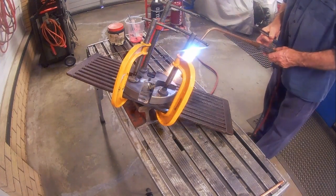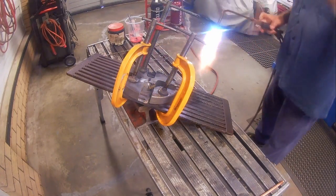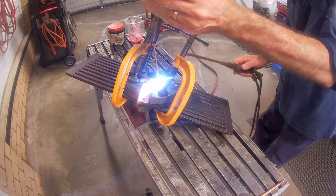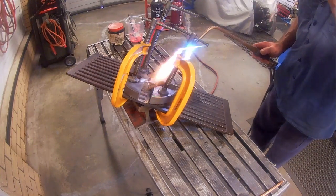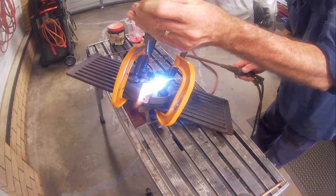And clutching a short length of flux coated nickel bronze rod and a pair of pliers. After all, nothing wasted here. I start the brazing process, again building a dam wall at the lower end of the joint.